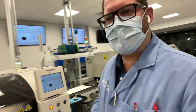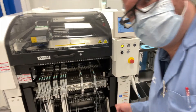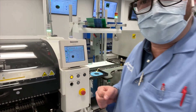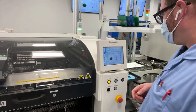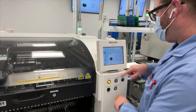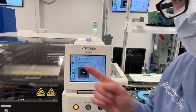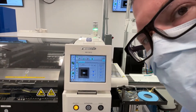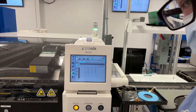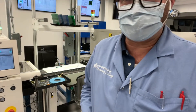And then ultimately explaining how to be predictive rather than reactive. On the pick-and-place line, how to make sure that feeders are loaded into the correct places, how to test that the correct nozzles have been loaded in — such as our Panasonic pick-and-place system right there. How to check that this system is able to accurately scan a part, pick it up, one after another. Right now it's doing what's called a gap-confirmed test, moving with a part that has a recognizable polarity marker, confirming it sees that polarity marker each and every time, just as programmed — and the brightness test has been performed.